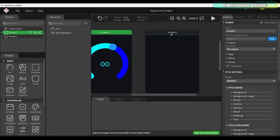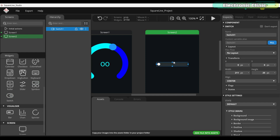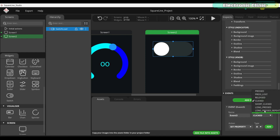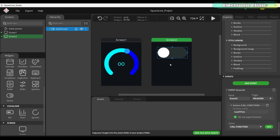Now let's move on to screen 2. Select screen 2 and from the Widgets tab, select a Switch. We can tweak the styling of this switch as well, but it already looks nice, so let's not waste any time on that. What I want is: when I turn the switch on or off, it should call a function to control the LED, either turning it on or off. To do that, while the switch is selected, scroll down and click the Add Event button. Set the trigger type to Released, set the action type to Call Function, click Add, check the box, and write the function name. Both screens are ready.